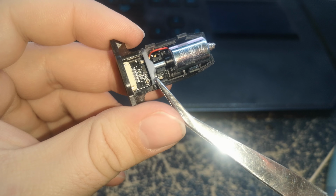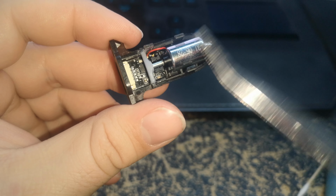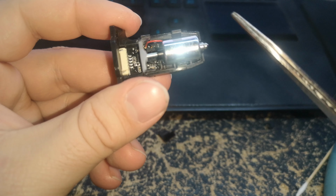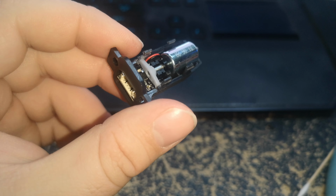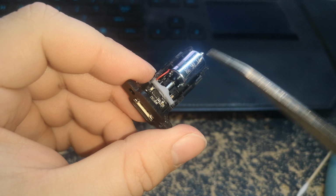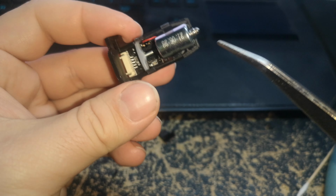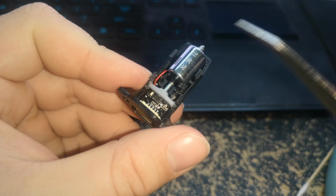But a different PCB version with a big chunky capacitor to give a good pump of current to overcome resistance would help fix a lot of this issue, so you could have tighter fitting parts to hold it still. What's the other thing? A Teflon liner inside of this might help. Tightening up the tolerance there and there with Teflon would stop this from rattling around, and it would have a Teflon thing to ride against.